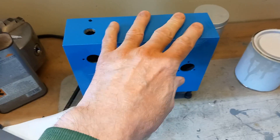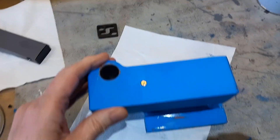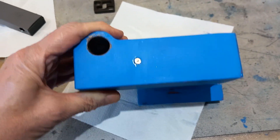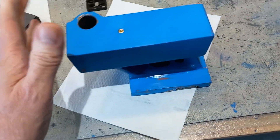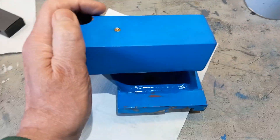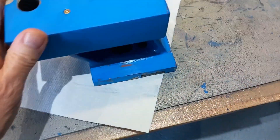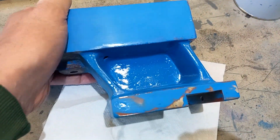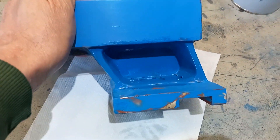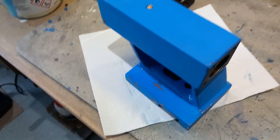The gearbox is painted and the paint is hardening nicely. This is the last bit to do — it's been rubbed down. Generally I've had to remove all the paint, but in some cases like this the paint is really solid and well adhered, so there's no point — it provides a good base. I've had to do a lot of filling and a little bit of machining to get that nice and square and flat, but yeah, the last bit of blue.